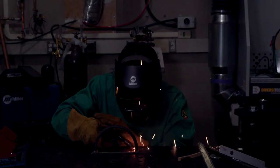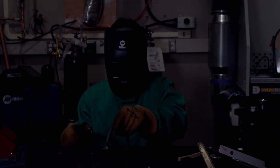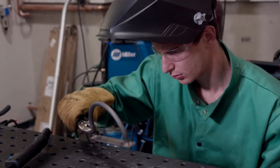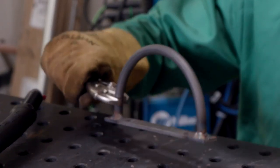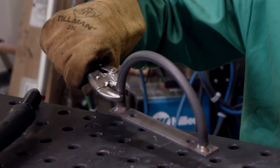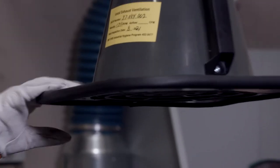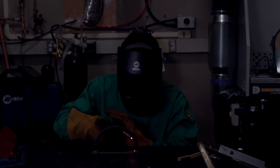As with all shop tools, there are a few hazards that accompany welding, so appropriate safety equipment is very important. Bright UV, infrared, and visible light from the arc can blind or sunburn, so make sure to wear a protective helmet designed for welding. Hot metal can burn your skin, so wear thick gloves and a welding jacket. Fumes emitted from welding can be toxic, so always use exhaust ventilation. Sparks can start fires, so always work in approved hot workshops.